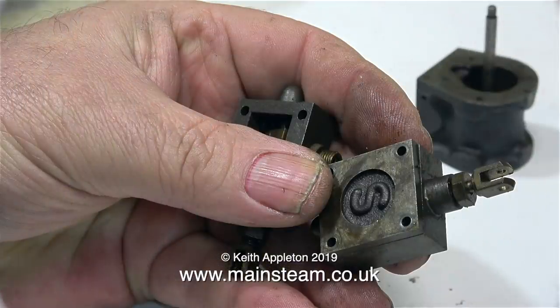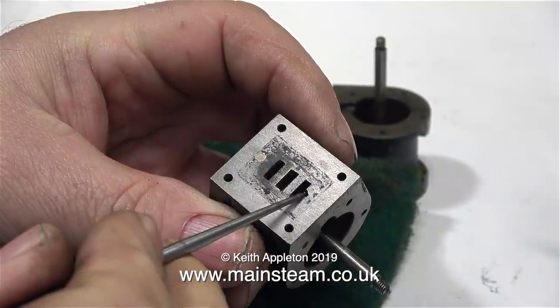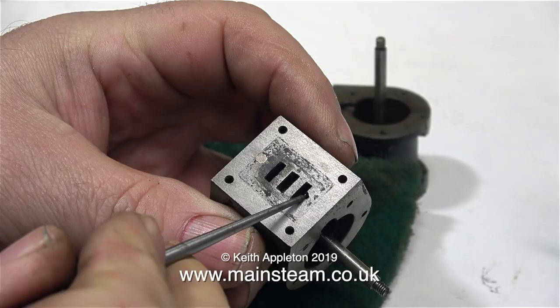In the first episode of this short series, I showed these — a pair of steam chests and one steam chest cover, complete with a slightly out-of-focus cylinder in the background. These are very well made. Look at how accurately the holes in the steam chest covers are drilled, and the holes in these covers are a perfect match for the ones in the steam chest. Whenever I see a model steam engine in a photograph, this is the first thing I look for — nothing looks worse than nuts on studs in holes drilled in the wrong place. The holes in the corners of this cylinder are definitely drilled in the right place, as are the holes at the front and rear of the cylinder block into which studs are fitted that hold the cylinder covers in place.